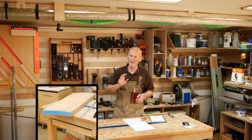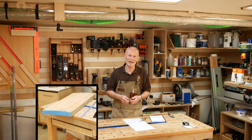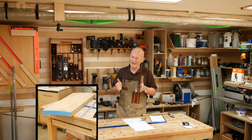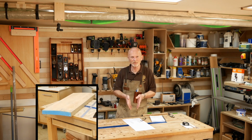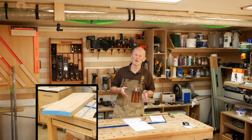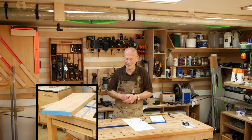But if I did it that way, the thought occurred to me that there's such a cup in the piece that it may well transfer into each individual piece, and I'll end up with useless cupped pieces of timber. And also, if I decide to embellish on the design, make it a bit fancy, different coloured handle, that sort of thing, then that doesn't work well with that. So I've gone down the route of cutting it up and making smaller boards, which is arguably a slightly longer process, maybe, I don't really know. I didn't do it the other way, so I didn't get to time it.